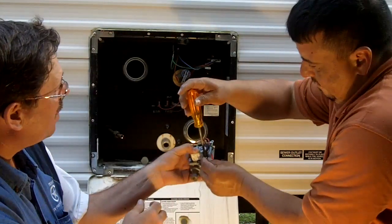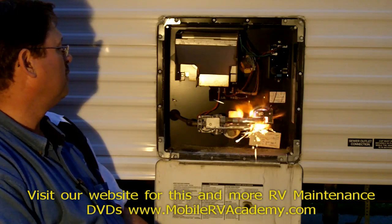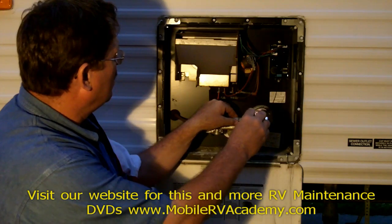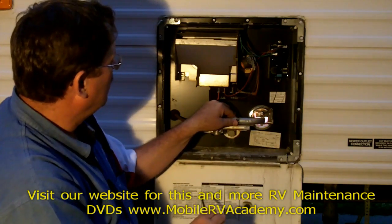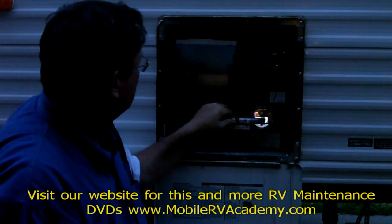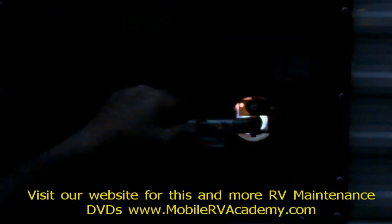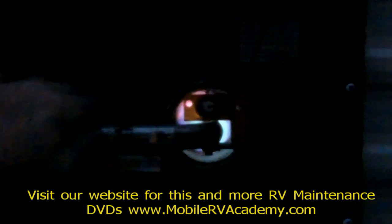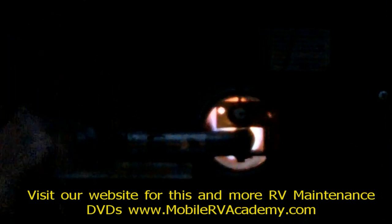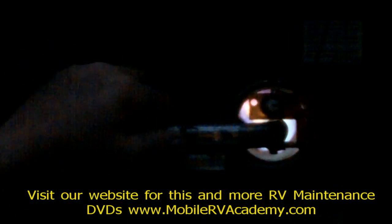This gas valve is not repairable. We can turn the light out. See how much quieter it got? What you're after is a nice blue flame with just a little bit of yellow tip. Now let me open it back up for you so you can hear it. This is the way it's supposed to be running right now — it's got a nice, good flame and it's kind of quiet.